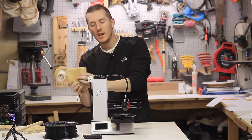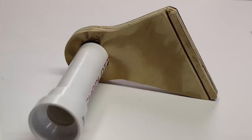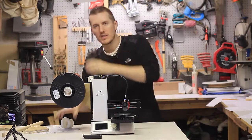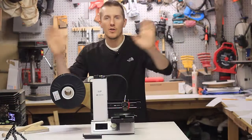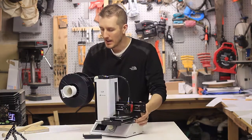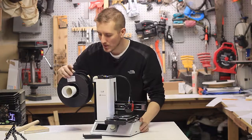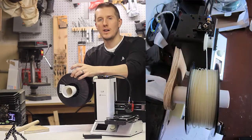The final design is that same idea but with a two inch PVC pipe on the end. Once you get it snapped on nice and tight, you can adjust it to any height because you want the filament coming off not too high, not too low. I added an end cap to keep the spool from traveling along the pipe and possibly falling off. That's it — no bearings, nothing moving. It's just a wooden triangular piece that snaps onto the printer and rotates on the PVC. Two inch fit fine; it wasn't too small where all the force is on one point — it spreads it out.